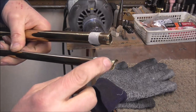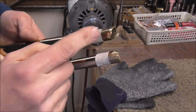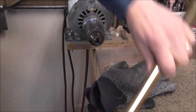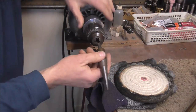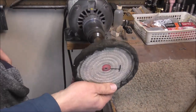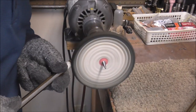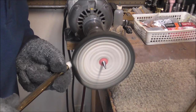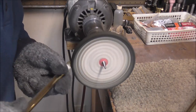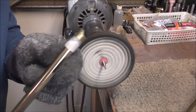It's taken a while but I finally got this fit onto there. I had to file it down more than I expected, but they do fit together. I need to clean up the lacquer so that the solder sticks to these parts, so I put some masking tape on there to protect the lacquer. I'm going to buff off the lacquer with triple-E buffing compound, putting the spindle in the bench motor with a buffing wheel. The lacquer comes off fairly quickly — the lacquer has been cleaned up and solder can stick to that now.